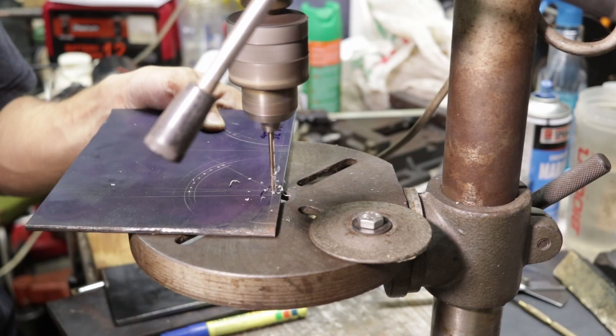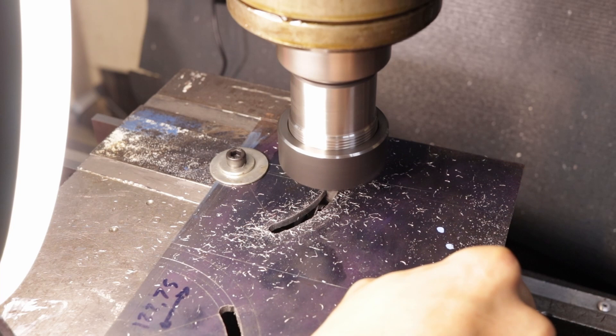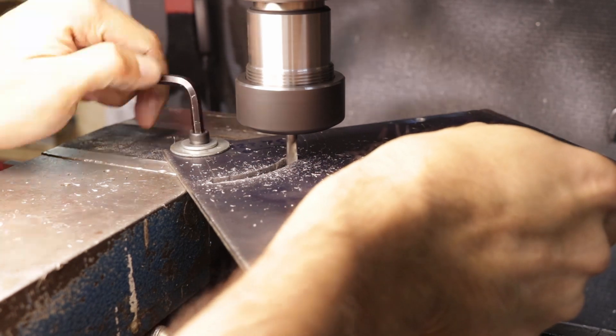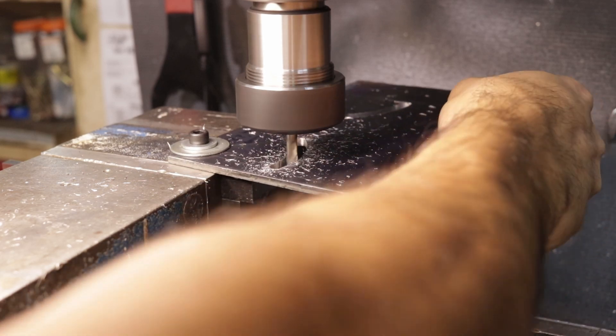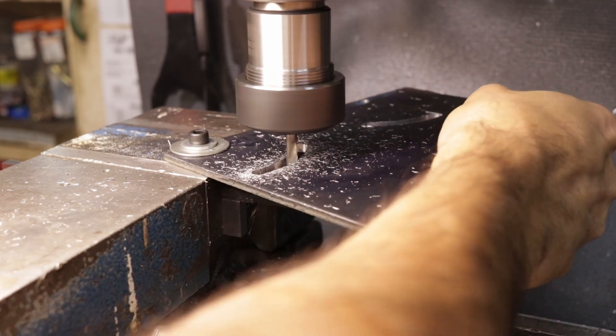As a side note, I made these angled slots quite simply by drilling them out, and then very carefully conventional milling them with some resistance by bolting that plate down. You have to be careful to only use conventional or push milling. Going the other way, you'll quickly notice it'll try and pull the part from your hands, and break the cutter, and the setup, and possibly you too. So proceed with caution.